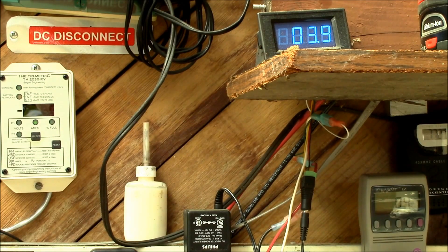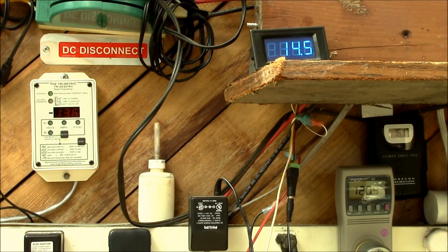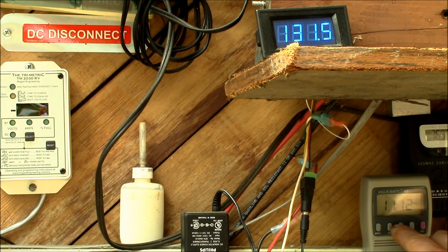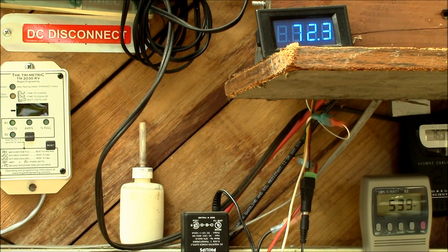It's on a soak cycle, slowed down a little bit. This is the tricky part of the cycle — there we go, the inverter is a little upset. We're running over the limit. That was 11 amps for a while. That's the hard part where it's got to start up the spin cycle, spinning the water out of the wet clothes — all that heavy inertia to spin up takes a while.